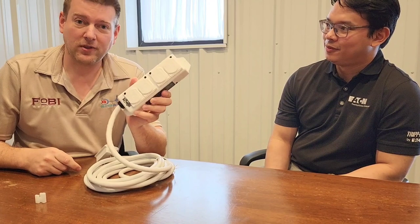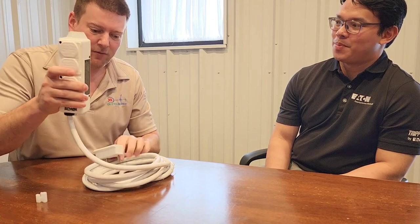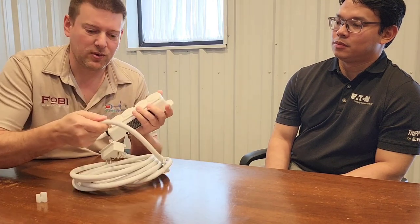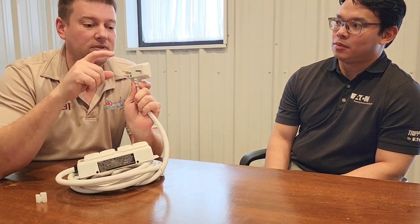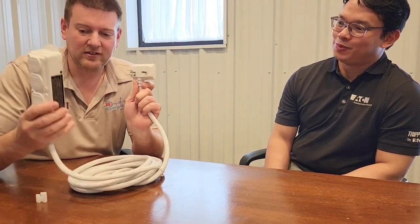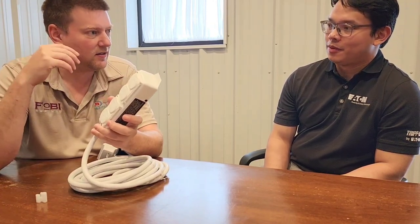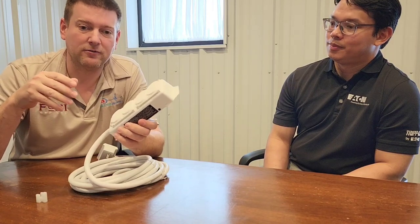I'll leave the information in the description below. It is on sale right now — correct — so they do have them in inventory. I was thinking this would be like a massive power strip for use on, let's say, a crash cart if you wanted to hard mount it. Because it's so durable you don't have to worry about wear and tear, plus the redundant ground. Some facility outlets might have complications with one of your grounds, but now that you have redundancy it's twice as likely to eliminate any issues — even around EEG, where you might have ripple that can affect the patient's outcome. With a redundant ground you can guarantee you're getting the best possible ground for all your accessory equipment in your EEG department.